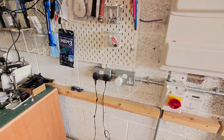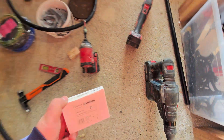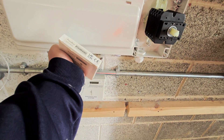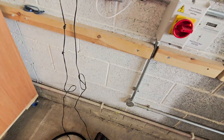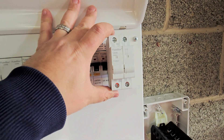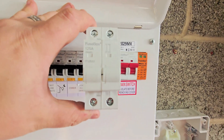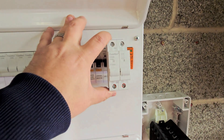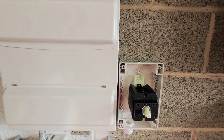There's a few little changes we need to make in there. When we fitted this board, they didn't have bi-directional RCBOs. And this solar PV wasn't in its upgraded state. But now we do have bi-directional mini RCBOs from Fusebox, so we're going to swap that in onto the PV inverter, which is living down here. It's currently this B32, so we're going to get that swapped. And we've also got one of these 125 amp connector blocks. The thoughts on that is to position it so we can take the main tails in there, then out of the bottom over to this changeover switch, and then return from the changeover switch into the main switch. So you have your grid supply coming into the changeover switch linked through this, and then you have your inverter supply into there as well, and then the tails out going into the main switch.